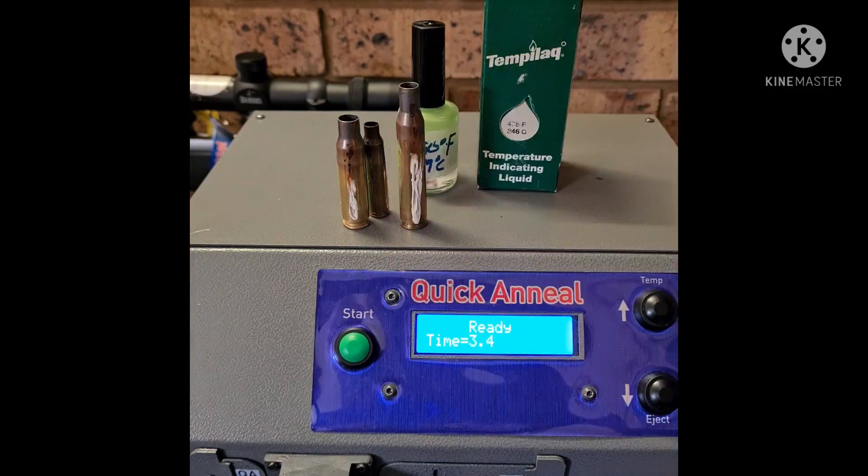We've proved more than beyond that it's safe — there's no annealing of the head stamp. Although it's warm to the touch, the amount of heat and energy does not produce an anneal. There are a lot of annealing videos out there — proper annealing, under-annealing, and all those things — but for a proper anneal on an induction annealer, anything from 980 degrees Fahrenheit is where the grain structure starts to change. You want to lock it in up to around 1020 to 1025 degrees Fahrenheit. As you can see, although we've annealed these cases, it never goes to 475 for most of the cases done here today.